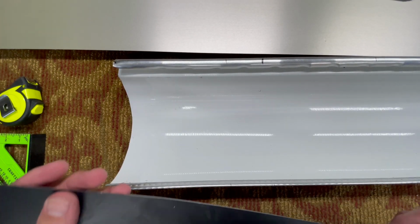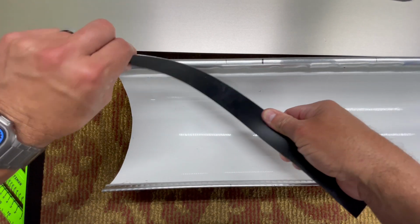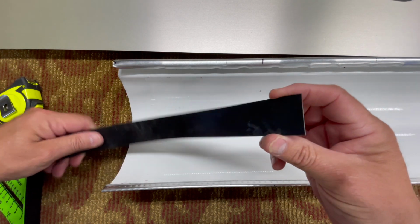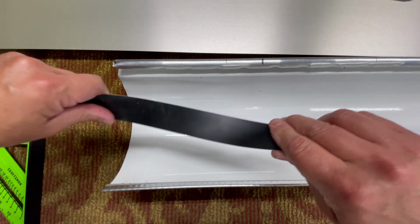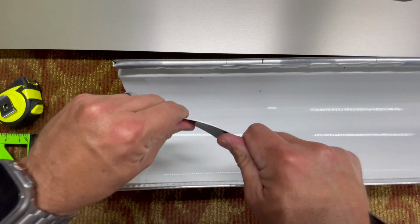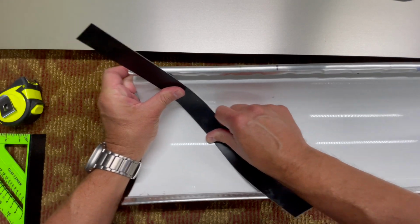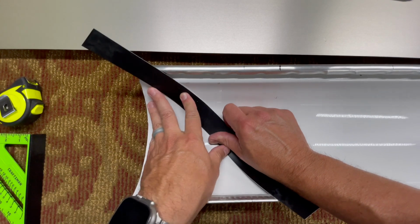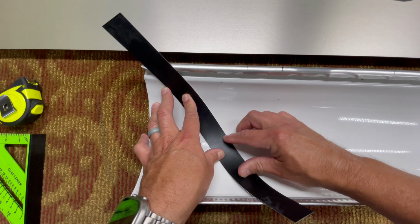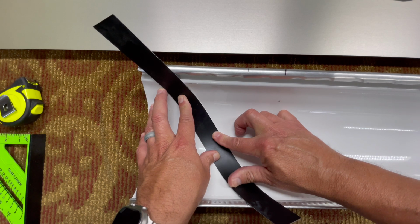so the next thing I like to do, this is the way I make them. Not that I make a bunch of them, but I get a flat piece of metal. This is some downspout band material. It's gutter coil, but we usually cut them at 1.5 inch strips. But I went ahead and cut us a piece. I'm going to twist it a little bit like this, and then we got to get this in here, so it's got to meet this corner. It's a little bit tough, so just bear with me here. Got to make sure it lays down flat. Okay, flat is the key through the whole thing.